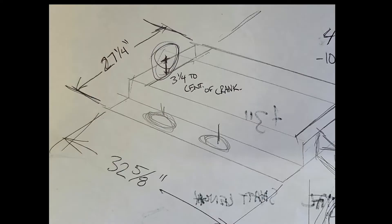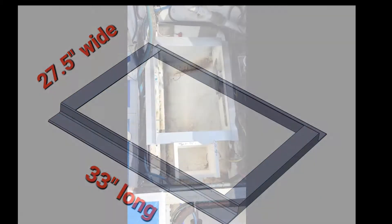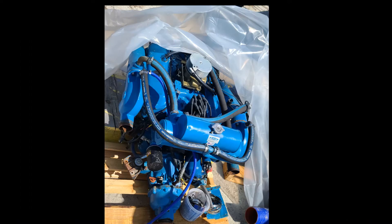This is a sketch of the engine jig. We will use this engine jig a lot to place the stringers, set our engine beds for propeller shaft alignment, and for setting the shaft log in place. There it is, set in the engine room. None of the stringers have been removed at this point, so we couldn't actually put it where we wanted to.